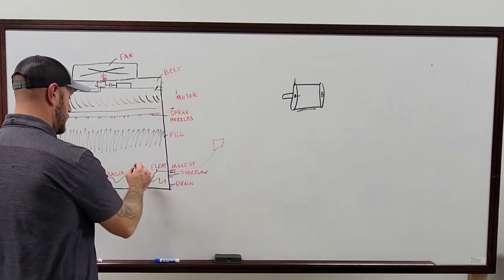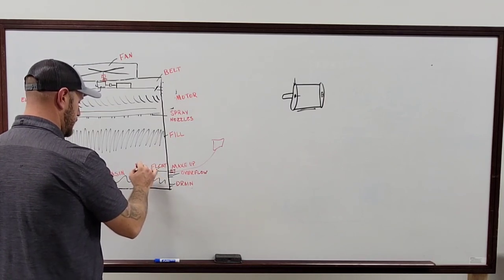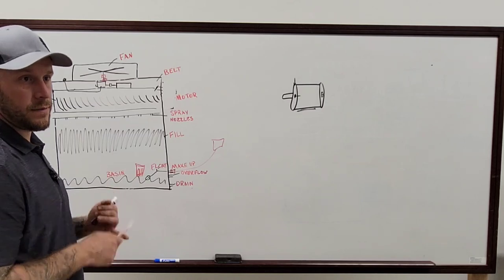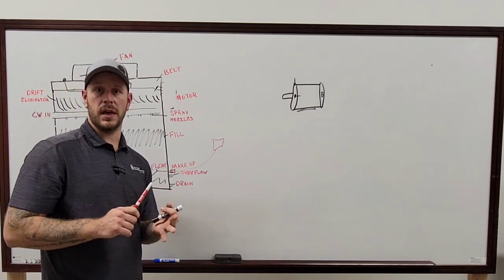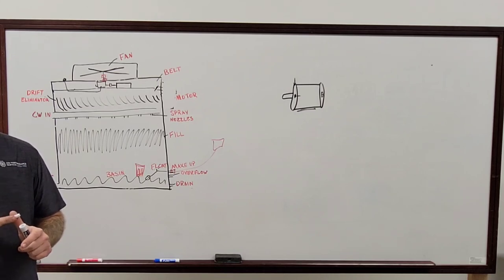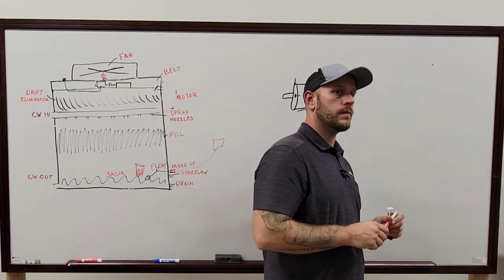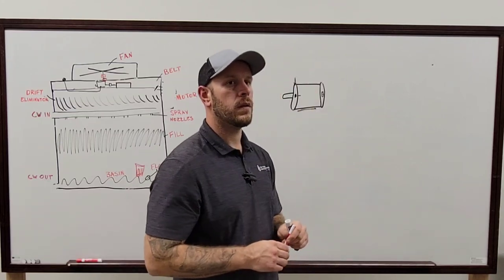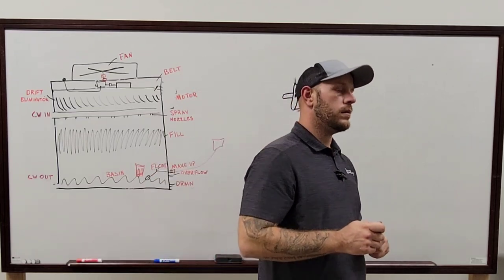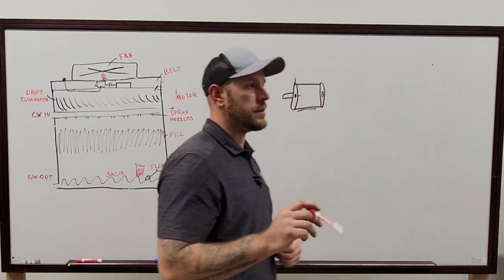And then somewhere inside the tower we have a PVC tube mounted, and it's got, I believe, 5 different rods in it. It's either 4 or 5, but they're all different colors in that controller. It's got low alarm, high alarm, overflow, fill, and what's the white one? Ground? Right, and then you have your ground rod, or your continuity rod. That one's your longest. Yep, that's the long one. That's the continuity rod.